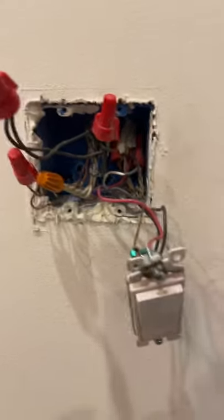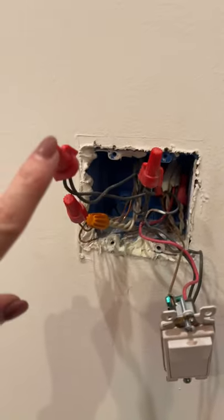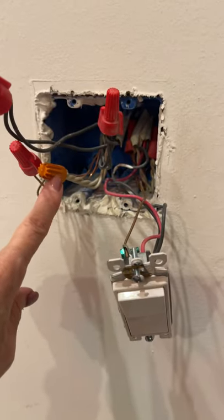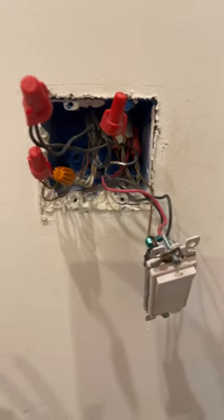You don't use a wired switch for this. Where before you had a switch with hot coming in and hot coming out, you're going to wire those together — that's one thing you need to do. Your neutral white is already wired together normally, so make sure you handle that part.